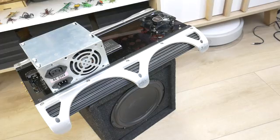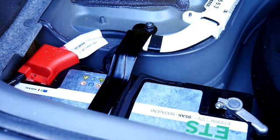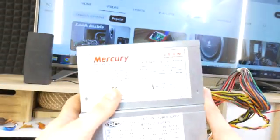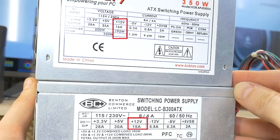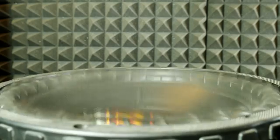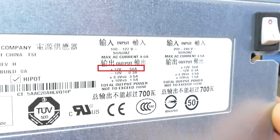Once the audio system is found, the next thing you need is a 12 volt power source. A car battery is not the best source because it will run out, and then in the evening your grandmother will not be able to start her car. The best way is to use an old computer power supply unit or PSU. These have a 12 volt output — the more amps at the 12 volt output, the more power it will give for a car audio system. The amount of amps varies from power supply to power supply. When you get big bass from car audio subwoofers in the home, you will like it and want more power. Then you can use a server power supply, which has significantly more amps and costs less.